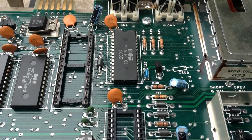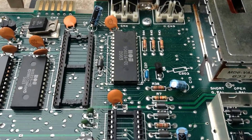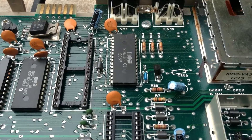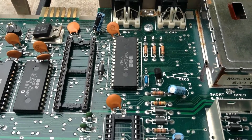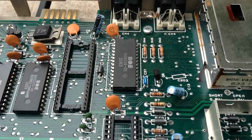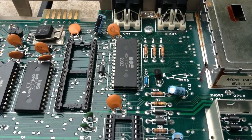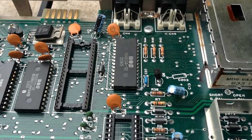Hello and thank you for coming. It has been a very long time since I have de-soldered a chip from a circuit board. What irks me is I have somewhere — that I cannot find — a beautiful soldering iron that takes different tips, letting you put an expanded tip like a little bar down the side of a chip. It melts all the solder on one side, you pry gently, the chip comes out. It might take as much as 30 seconds to get a chip out, but I can't find it, and nobody seems to know what I'm talking about.